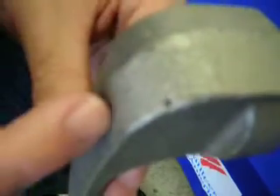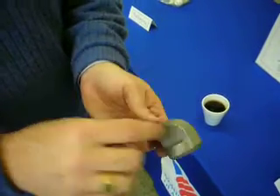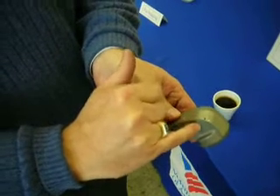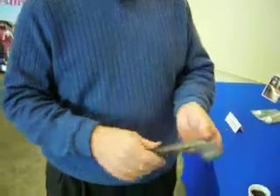With this part, the customer — who is a company called Everhart Manufacturing — would be machining this area and then pressing in a shaft into here. What that does is it puts a lot of pressure on this area, which is called the knuckle. And if you have that spider web type effect down in here and a lot of pressure, you can get a good chance of breakage. And we were inspecting those.